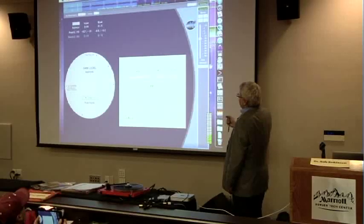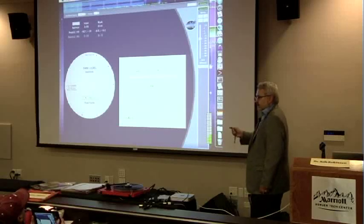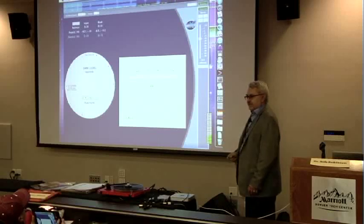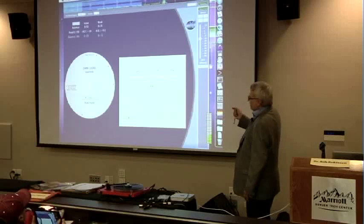Why is that important? Because you've already got 24 bits of audio. The reason it's important is that when you set your input levels, you don't have to be really obsessive like in the old days of cassettes, where you want to squeeze out the maximum amount of signal-to-noise ratio. You can get this just up to about -10, and those extra 2 bits in the RIAA curve come into play, 12 dB. So as long as you're within this window, you have the optimum signal-to-noise ratio.